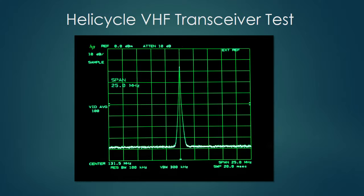To give you an idea of what that means: a signal 60 dB below the carrier would be one-millionth of the carrier level. There's nothing visible down there, which means this signal is extremely clean. I'm looking across a 25 MHz span — the whole aviation band — and there's nothing to be seen at all.